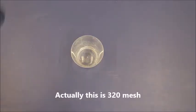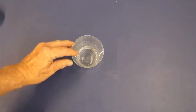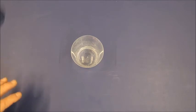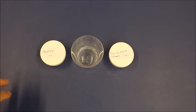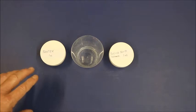The last ingredient that you will need is some water. Now, when you are mixing this, some manufacturers recommend that you use distilled water, but I use that out of my well. I have found that there is no deterrent to using whatever water you have available. Use it at room temperature, and if you get it too hot, it wants to cure quicker, so be careful about the temperature. Now, I use 1 ounce of water to 1 ounce of plaster and 1 ounce of silica sand. It makes a rather loose mixture, but I find that it pours into small molds very well. If you want the investment mix to be stiffer, just use less water.